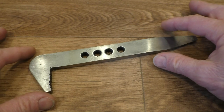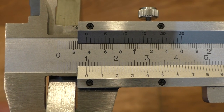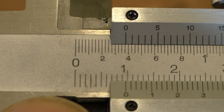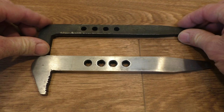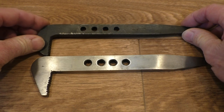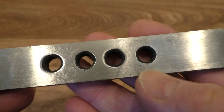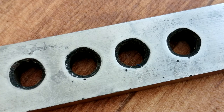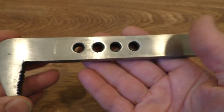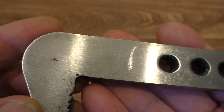Let's take a look at the hook. So he's machined out the hook from a chunk of fairly hefty material here. Using the vernier, we can see it's 9.5mm thick — or 3/8 of an inch thick, which I think is more likely what it will be: 3/8 of an inch thick stock, like this original hook. Mr. or Miss Knot has drilled four holes for the pivot pin adjustment, and they've obviously been counter-sunk with the drill bit to take the burrs off, because you've got this slightly hexagonal shape going on with the holes on both sides. The chances are he's probably hardened it as well — these holes are all black in there, they're not being polished like the rest of it. And I think there are signs of draw filing going on here too.